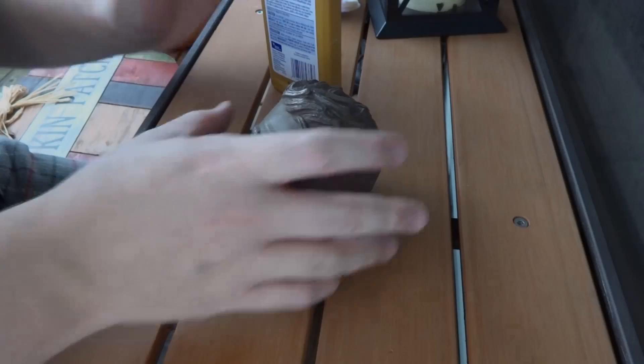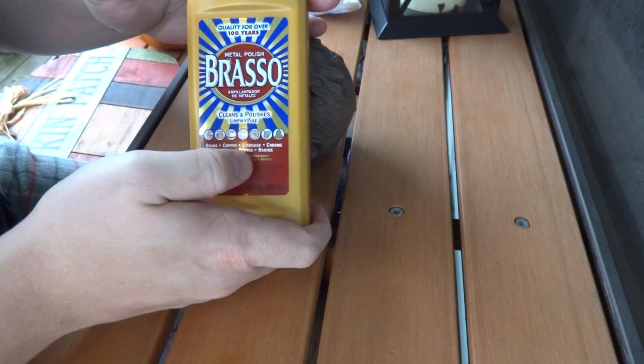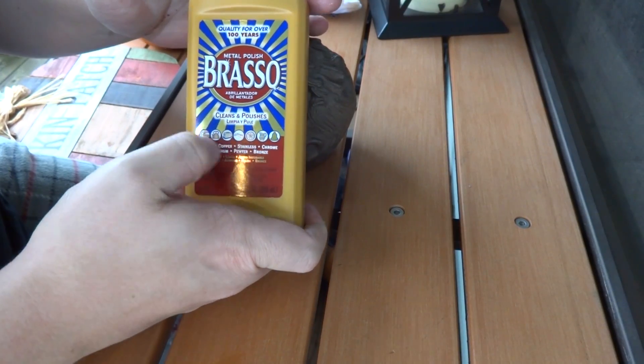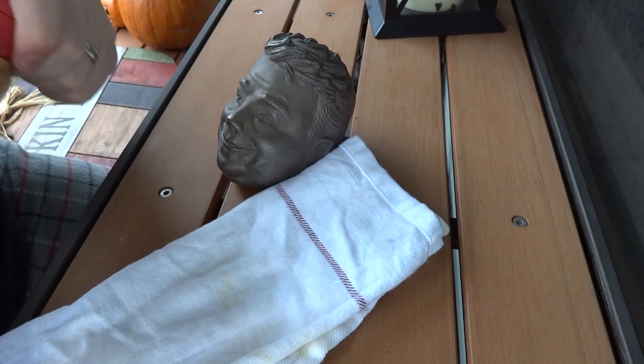Once you polish something in the media tumbler, I recommend taking it out and finishing it up with steel wool if you want a show-quality piece. There's also a little tiny chip out of the ear — I think I damaged that when I was playing with it earlier, not from the tumbler. But that is a pretty amazing end result. Just like with the coins, it has kind of that grayish shine — the bronze isn't coming through except down inside the hair and detail areas. I definitely want to use some Brasso on it and see if we can bring some more of that bronze color out. We're back outside — I'm using Brasso right here, it's a cleaner and polisher that works on brass, stainless, and all that stuff.